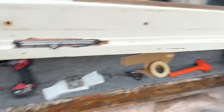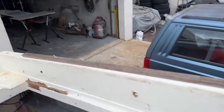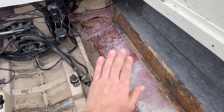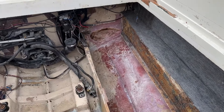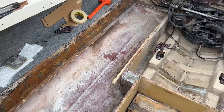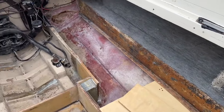We'll probably end up doing a layer on the floorboards now. I'll pull this one out and do a layer on it. And then when I go to do this section, I'll lay some glass on it. And then when we're all said and done and the floorboards are in their final position and we cabosil them, I will chase them probably with one more layer of glass all inside the boat.